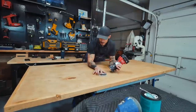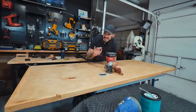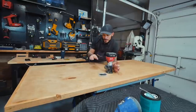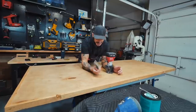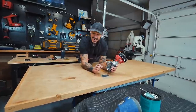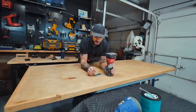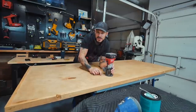This is the inside of the door — the bathroom side. The outside is no problem to open, but the inside will be tricky. So we need some hardware. I picked up these 1x3 flush pulls. I'm going to use a router to cut in about a half inch deep, then screw them down so we'll have a nice, clean, subtle little opener on the inside.